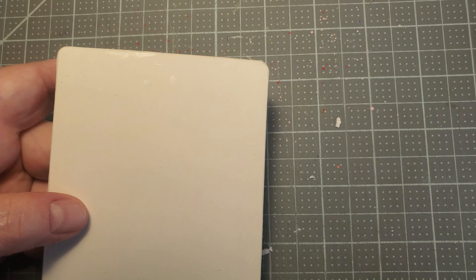Something came up that sometimes happens on the table or anything that's curved like this. Can you see that little gap right there? It's bothersome. I was fortunate in that I didn't really get that on the top of it, but on the bottom there's this gap right here. What I wanted to show you is a little trick. I just picked this up at the dollar store — it's lightweight spackle. You can also get it in a tube. Always make sure you store it tightly closed because it'll dry out pretty quickly.